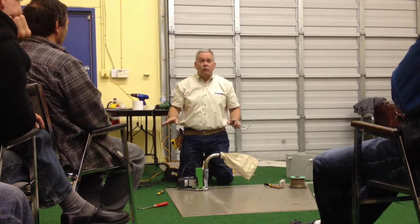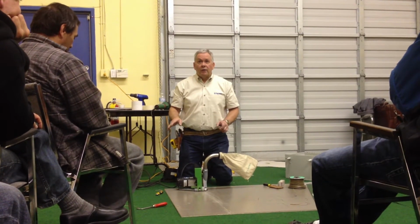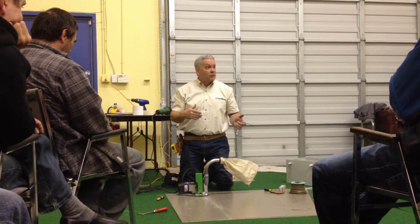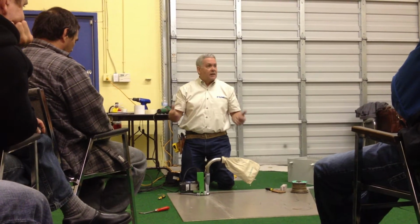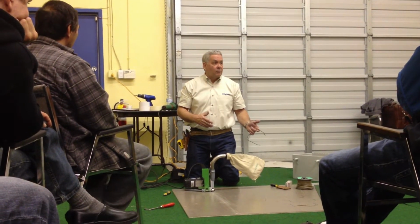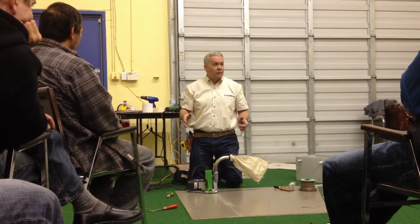I always check my groover first, and then I check my heat weld setting, because I have heat welded on, and even differences of my competitors, you know, because some are going to scorch easier than others. And don't assume that you can always do the same thing. If all you ever did was Tarkett, and one day you get thrown in with a competitor's stuff, I would not heat weld it until I was absolutely sure of what setting I could do it at.